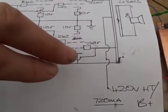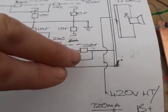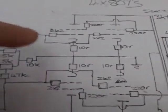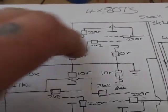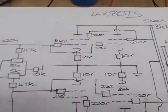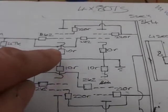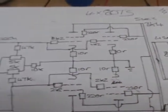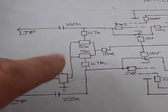This is connected in an ultralinear configuration, about 43% taps. On the grid twos we've got a 220 ohm grid stopper on all of the valves, and on grid one we've got a 2k2 grid stopper. Most amplifiers I've seen seem to have a 10-to-1 relationship between grid stoppers — something like 1k and 100R. These values I've just put in off the top of my head. We've got 10 ohm sense resistors in the cathode going straight to ground.